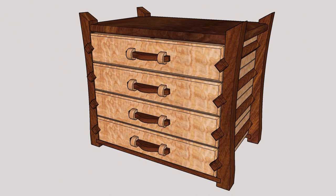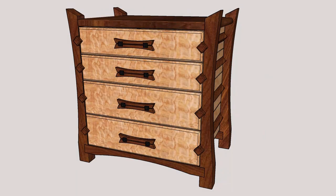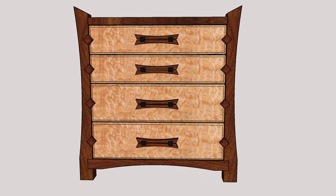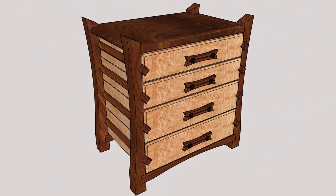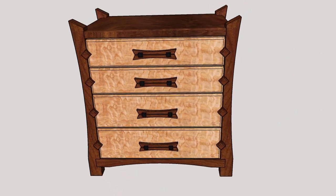At this point we began to refine the design a bit. We decided that the bottom two drawers needed to be taller and that we would like to exaggerate the curvature a bit more, so I made some changes. Now the chest has two larger drawers at the bottom and the drawers at the top remain the same. The legs have been widened to allow for exaggerated curves, and I felt this called for more leg protrusion at the bottom to balance the curve with the visual foundation. I also changed the bottom cross member to an arched profile which gives the chest a lighter, more elegant look. The change that made the biggest impact was the drawer pulls — this variation has opposing arches that flare out from each other and share two central posts. Once these revisions had been made, the client and I agreed that we had arrived at a completed design and it was time to get started.